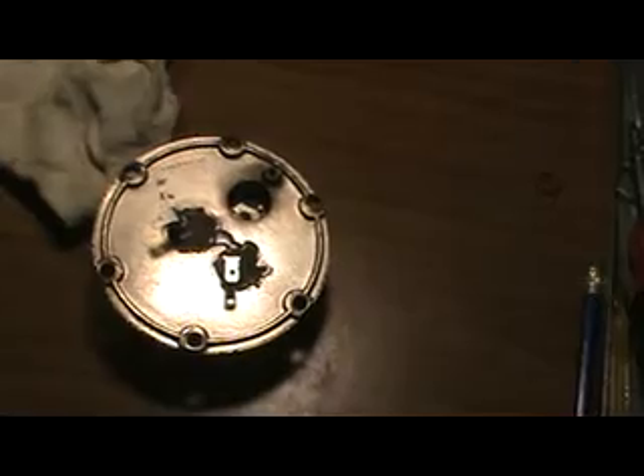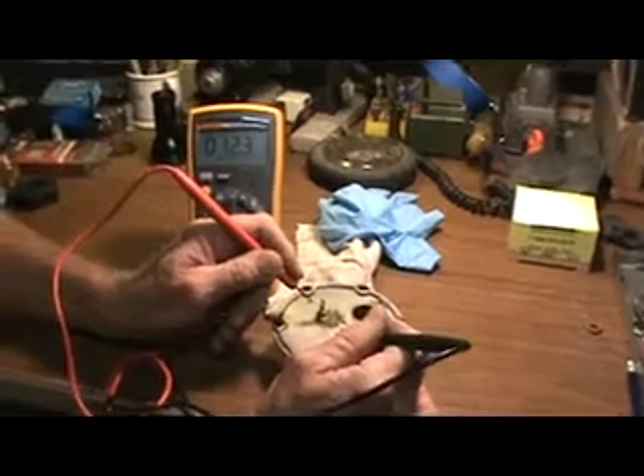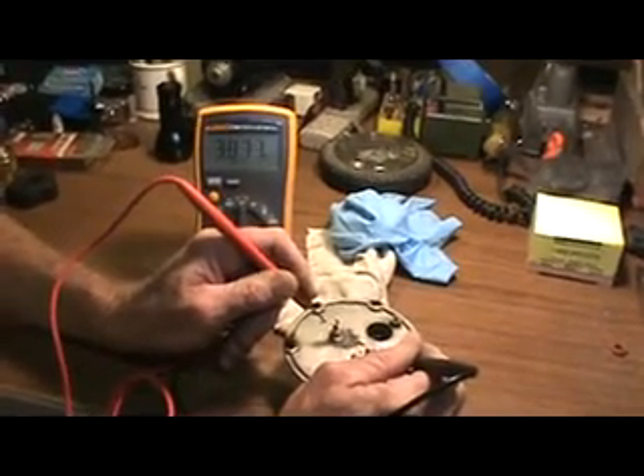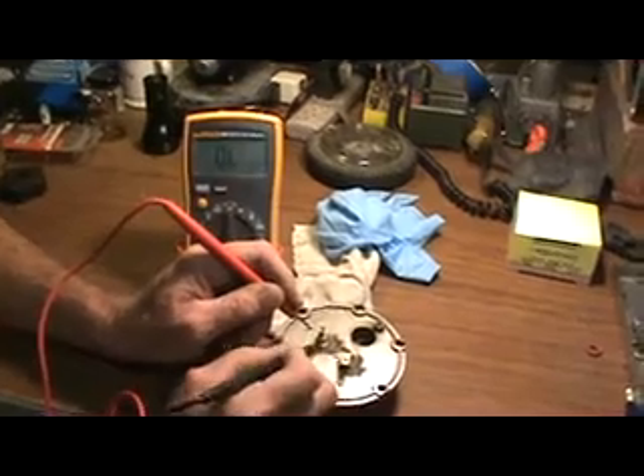Now let me talk about this — it's a big issue. I'll grab my meter so we can really see what our readings are on this heating element situation. We set our meter on ohms. On the terminals we read 12.3, 12.4 — that's about right for this 1000-watt element. Then we go over to the metal base plate — that is the water short. Notice the meter never stabilizes; we're up to 40, 46. This indicates that water has gotten inside the terminal ends — that's the hope.